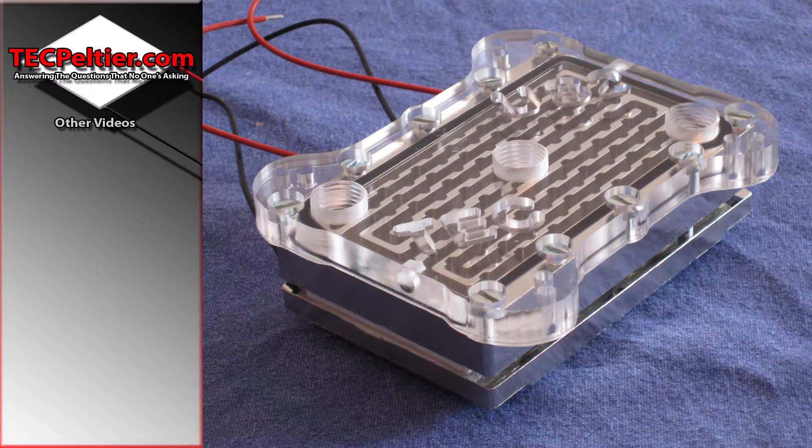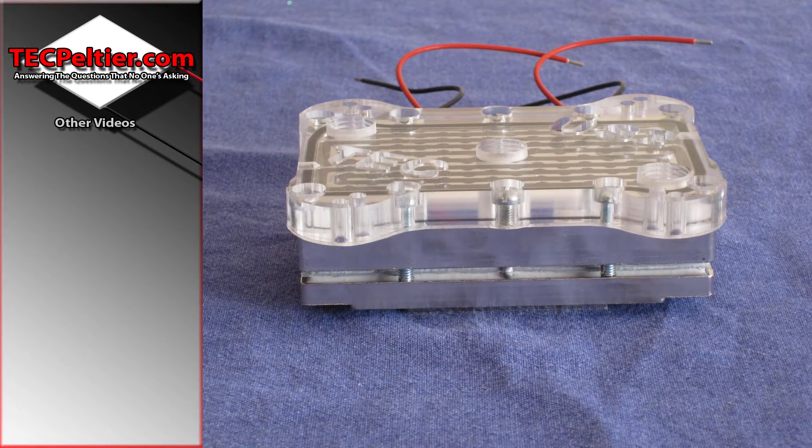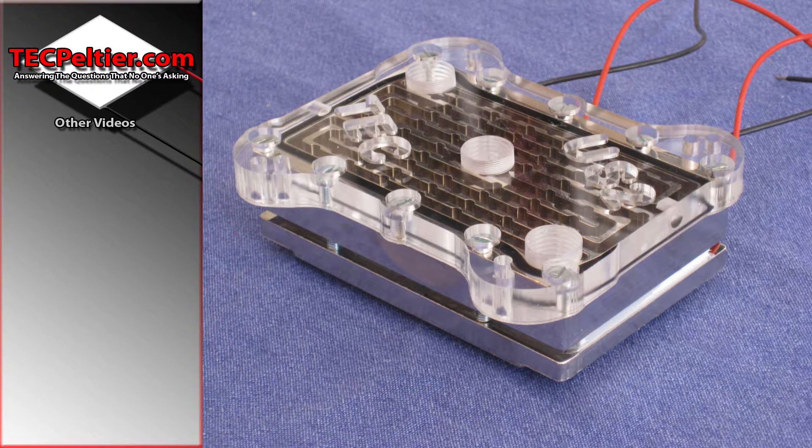This also has my little cut-outs. If you look at the channels, they've got these little cut-outs. The reason for those is it increases the surface area and increases turbulence, which in a block like this are total bonuses. They are also cut lower into the block, so it's not only the water going past the sides — it's also the water going along the bottom that gets this benefit. As the water runs down the channel it reaches a cut-out of a different width, which causes a little whirlpool. This whirlpool increases turbulence, which is a good thing because it reduces the laminar effect, which we will cover in one of my videos later on.